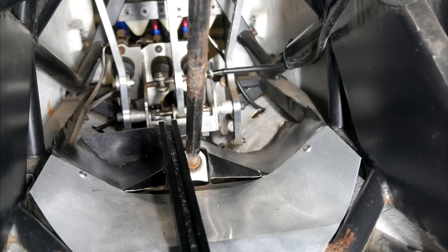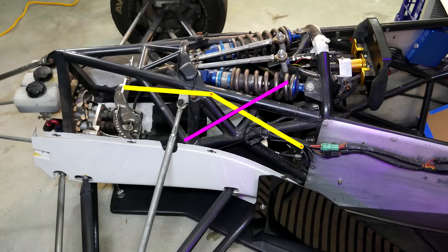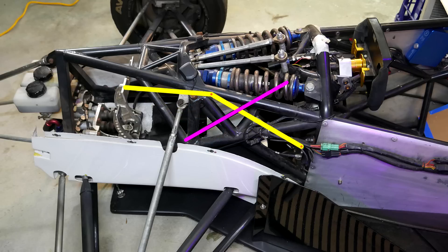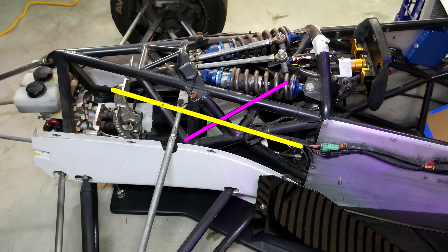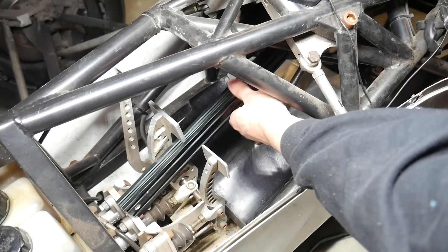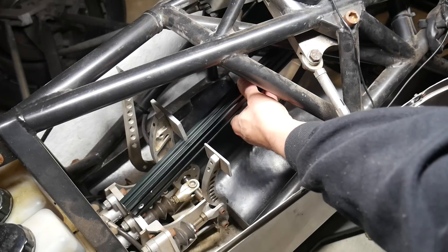With the first part of the leg bolted into position, I put the anchor into place and revealed my first mishap. Looking from the side it was clear that the leg was fouling the steering column — shown in purple, with the original leg measurements in yellow. Everything's fine until the leg goes down and then the pivot point rubs on the steering column. Fortunately this is a very easy fix: we keep the same total leg length, but change the proportions to have a short section next to the pedal, so when it straightens to push in the pedal, the pivot point in the middle is nowhere near the steering column. The fix is simply to install a longer length of 20-40 extrusion on the anchor side.